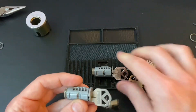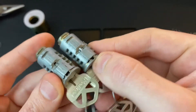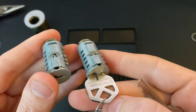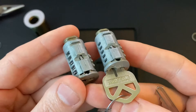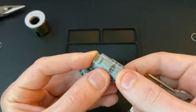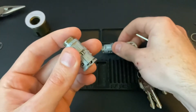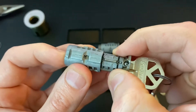So the thing you will notice on the sides here — the difference is the shape of the sidebar. I'm going to take the key out of this one so you can see it better. The Gen 2 sidebar is triangular — you can see that. The Gen 3 sidebar is square. So that is the primary difference. However, the other thing is that on the Gen 2 sidebar, the springs are underneath the sidebar — they are pushing it out. On the Gen 3 sidebar, you can see the springs are being held in by these black bands — they are pushing it in.